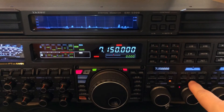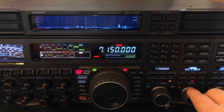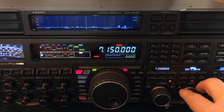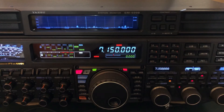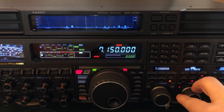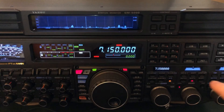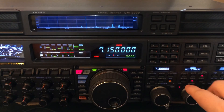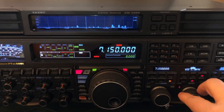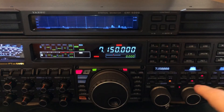I'm listening at 2.4 kHz wide because that's the default unless you press the width button here in the DSP unit and increase it. Sometimes actually going a little bit wider adds a little body to it. Sometimes going narrower is better for intelligibility. There he is back — no contour.